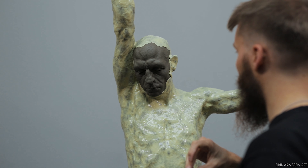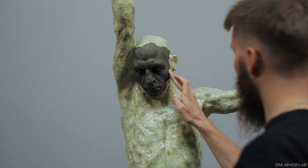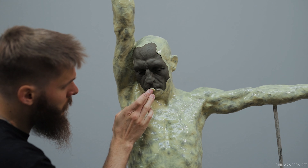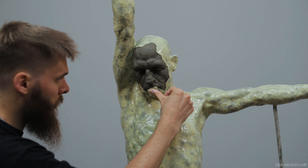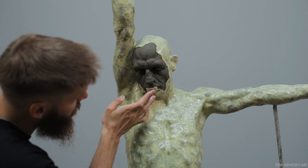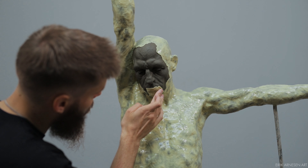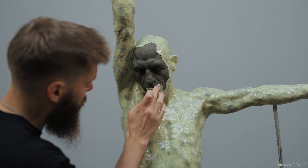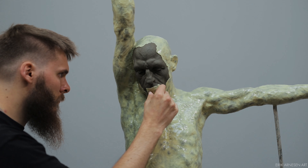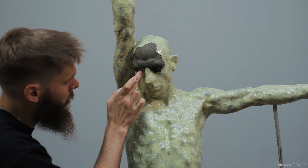There are many ways to apply the silicone. My preferred method is to kind of roll it into a ball, try to squeeze out all the air bubbles and get as much water out of it as possible, shake off the water, and then apply. I overlap the previously applied silicone to ensure complete coverage, then I always push the silicone out towards the edge — not back towards where I've already applied silicone. This ensures that bubbles of water or air are pushed out of the silicone, and the thickness is gauged by eye and a bit by feel, keeping it as consistent as possible.